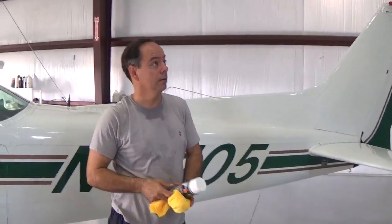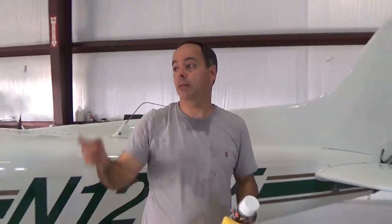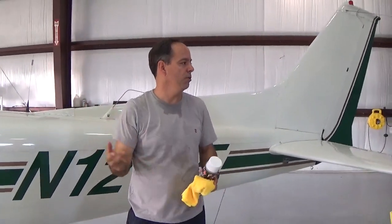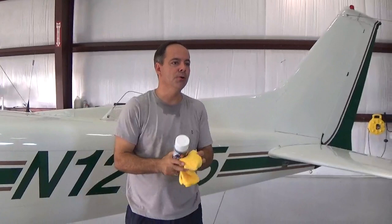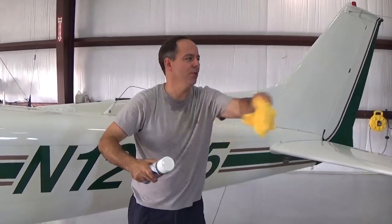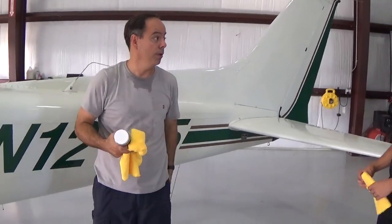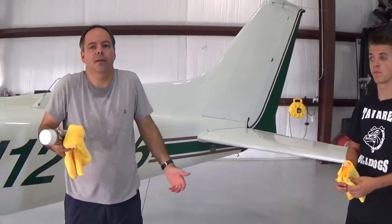Generally one of these planes is going to have flown and may just need a general wipe down. But if you came in next week and it's completely clean, we know the wing needs it — so you work on the wing that day. I'll show you the aeroglaze. All you're doing is putting a chemical on there, wiping it, letting it dry, then wiping it off. It's like a car wax.